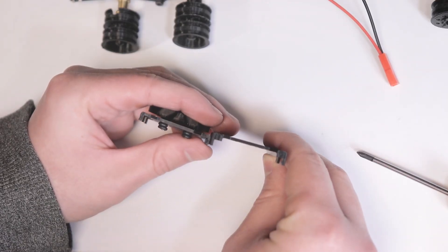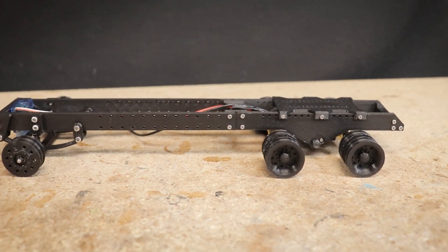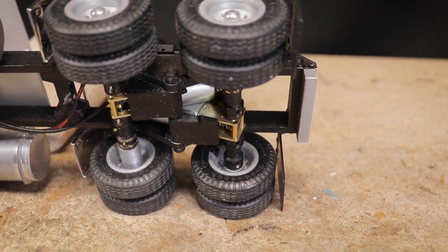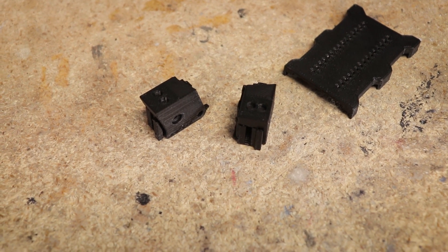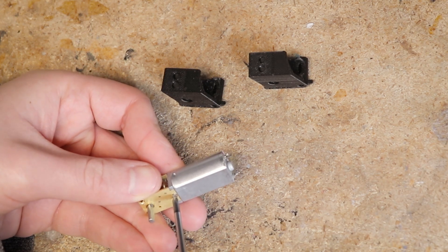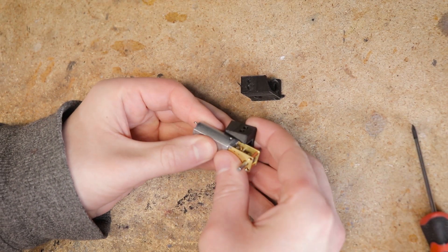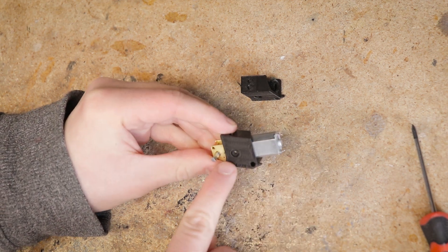In addition to that, there is one other new part you'll need if you want to install these N50 motors — that's the lifted fifth wheel mounts, which allows a little more room underneath for the larger motors. But those are the only parts that are different; all other parts on the chassis are exactly the same regardless. I'm printing these in PLA, which is plenty strong enough for an RC model such as this. I've yet to have any issues with the motors getting hot enough to weaken or deform the plastic, but if you encounter any issues with that, you may want to consider printing in a more heat-resistant material. Installing this larger motor is similar to the other ones — first, remove one screw holding the gear assembly in place, as you'll be replacing it with an M1.6x3 fastener. The only real difference is that it sort of snaps in from the side rather than sliding in from the front. It should seat fully into place, and then you can install the screw to secure the motor.